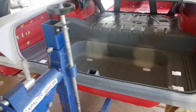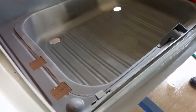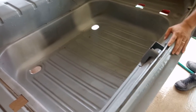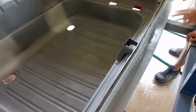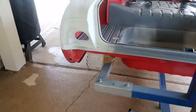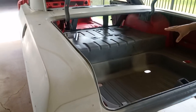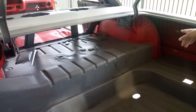The trunk pan — the center pan is replaced. The whole entire floor is replaced. The floor, the tub, the tail pan, the lock pieces, and the corners — they've all been replaced on both sides. The trunk has already been tested and lined up, and it all fits. The only original pieces left are that shelf and the wheel wells, though I did load in some new pieces on the wheel well.